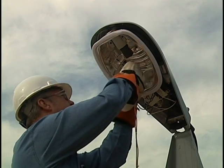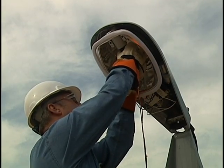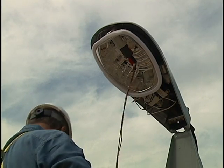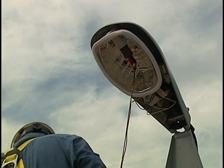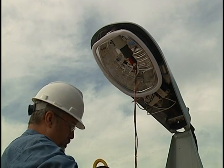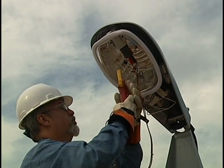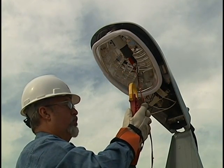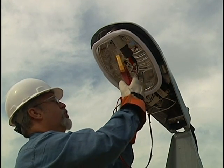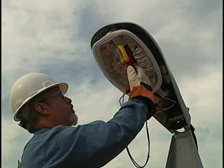Once the starter is disabled, proceed to replace the short cable with the red and black 42-inch safety cables, keeping the correct polarity — red to red, black to black — and connect to receptacles on the clamp meter. Apply power to the socket. Turn on the clamp meter and place on the voltage, or V, setting. Be sure to press the select button until the AC waveform is seen on the display.